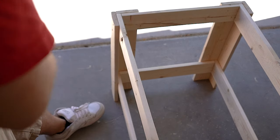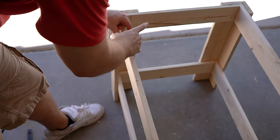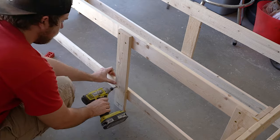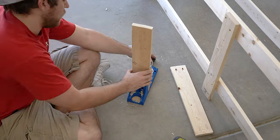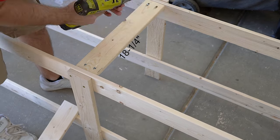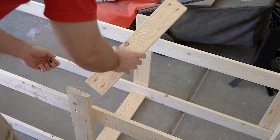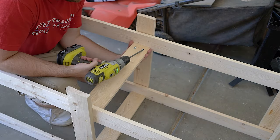I had a knot come loose so I squeezed a little glue in there, wiggled it back and forth, let it sit, and it was fine. I measured for center of the front face, added a leg to the front and one to the back at the same distance for a little extra support, since 1x4s aren't really that strong. Then I drilled pocket holes to add to the structure and beef up the strength — did it to the top, flipped it and did the bottom, so the pocket holes don't show.